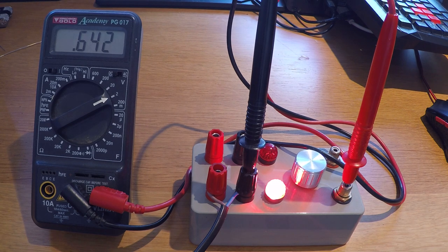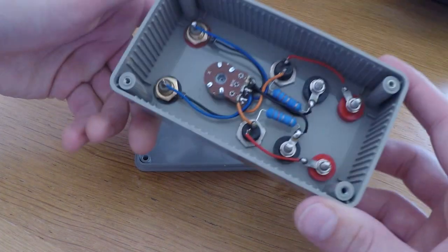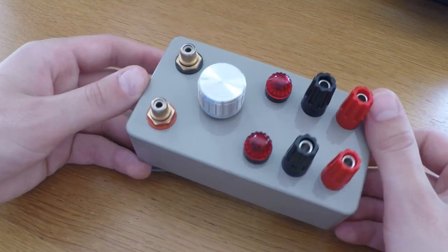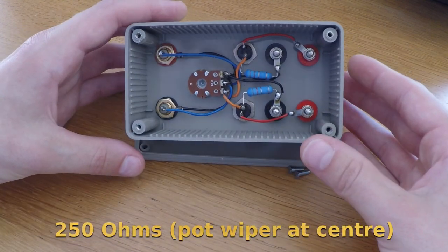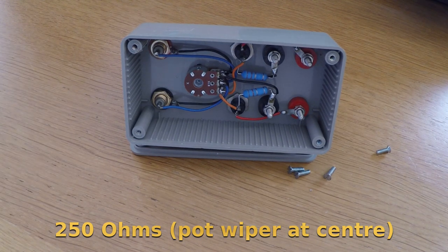The enclosure itself is of little importance. As you can see, I've used an inexpensive plastic one that I had lying around. It certainly won't hurt to use a metal enclosure at all, but seeing as the internal impedances are so low, there's very little risk of electrostatically coupled noise, so the benefits of shielding seem to be fairly negligible. It's always a good idea to keep wiring as short as possible though.